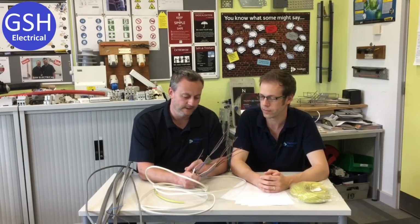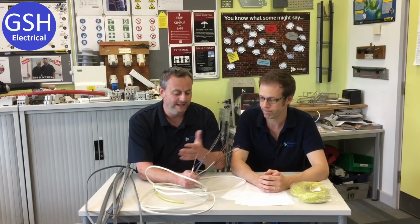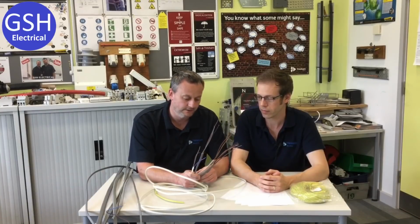It's going to be in that first 8 weeks in the workshop period, after health and safety has been cleared, that we're on those lighting circuits. We'll be using twin brown drops to switches, and we're interconnecting two-way and intermediate switches using the 3-core and CPC that you discussed in your video as well.